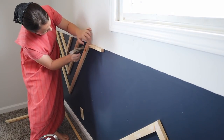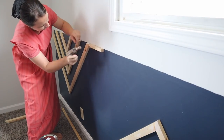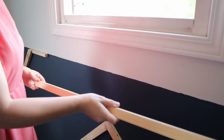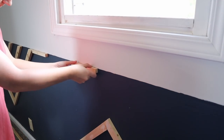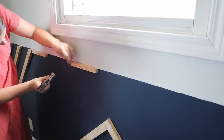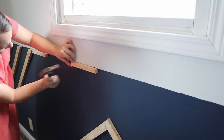For the top piece, I'm going to put a couple of braces here on the top because I'm going to put a trim piece up there, but first I need something to hold the trim piece. So I'm going to put a few little blocks here on top — especially where the splice will be — so that when I nail down the top trim piece, there will be something there to hold on to it.